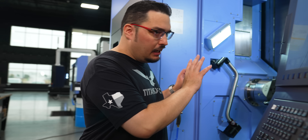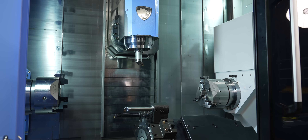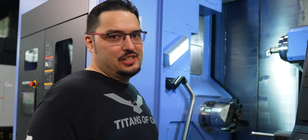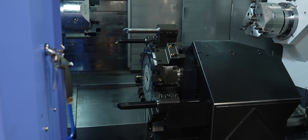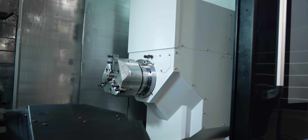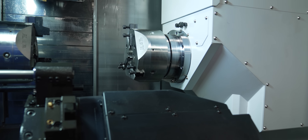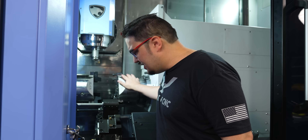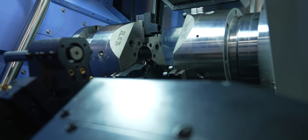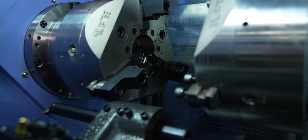This machine is a beast. We got 5,000 RPM lathe spindles. The top spindle can go 12,000 RPM and it's got 30 horsepower — that's crazy for this machine. One thing I really like about this machine is how close you can get everything together. Without having any plates on the back of the machine, I can almost bring these two chucks together, which is great for chuck transfers. This machine has a 2 and 5/8 inch diameter draw tube, so I can run bar stock that size or smaller.